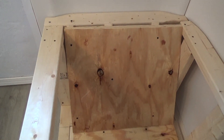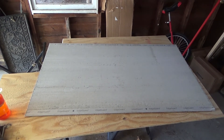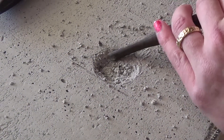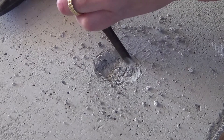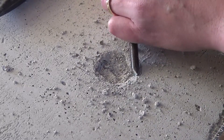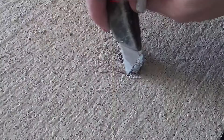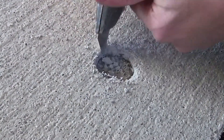So there's the plywood for the backrest. Once that wooden part was done, I'm on to using the cement board, which is nice. I started out cutting it with a utility knife and it worked okay because you can kind of snap it like drywall, but later I ended up using a diamond blade on an angle grinder.